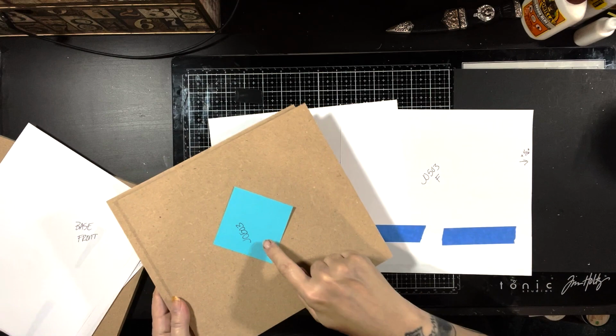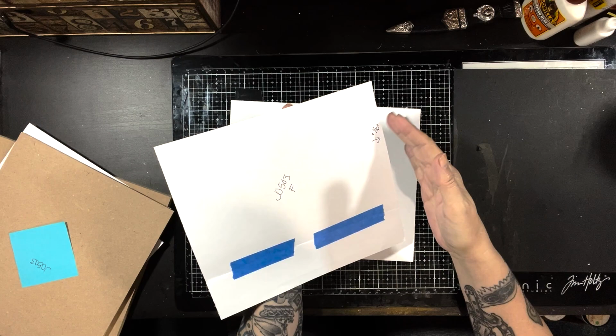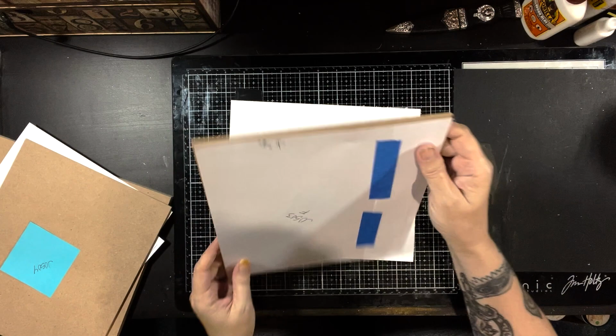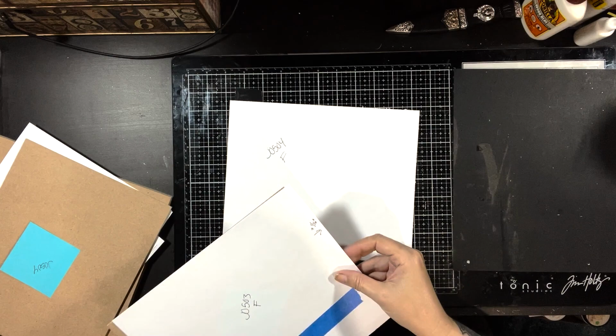And this one, if you'll notice, I've got its name, and then here it says plus 1/16. I cut it in a little too far. So when I went to put it back on its piece, I went to put it back on here. See how you see a little bit of that wood showing? So I know to just overcorrect by about 1/16 of an inch. And if anything, I can sand it back down. So that's our patterns. So now we can paint some stuff.